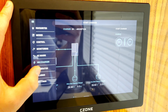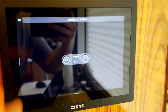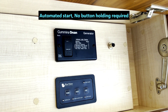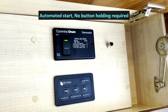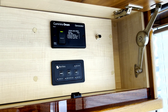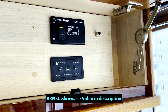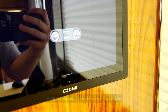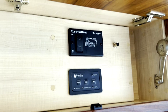We also added generator starting right through C-Zone, so we can start and stop the generator right on C-Zone. I'm going to actually start the generator now. I come up here to the analog panel from Onan — the gen just fired up. We'll see the panel go green as it runs. That was all done through C-Zone. It's really nice because it allows you to control the generator from other digital switches off the boat. On this boat we did a Barnacle system, which I'll show you in a second. But we can still use this analog panel as a backup, which is really nice. We're keeping an hour log right here on C-Zone, and then we can stop the gen right from C-Zone — lights go off.